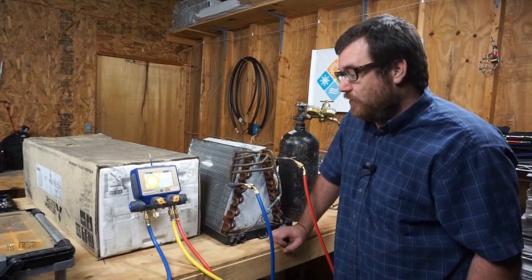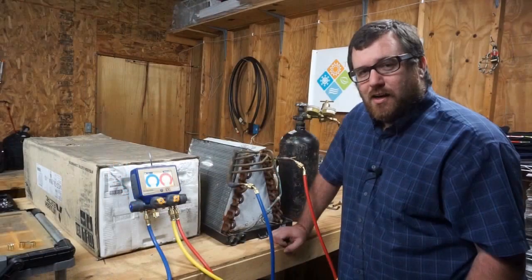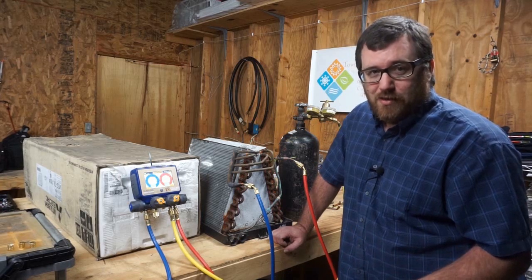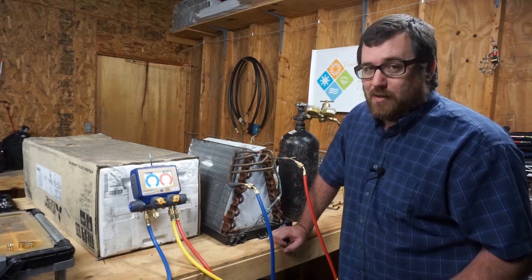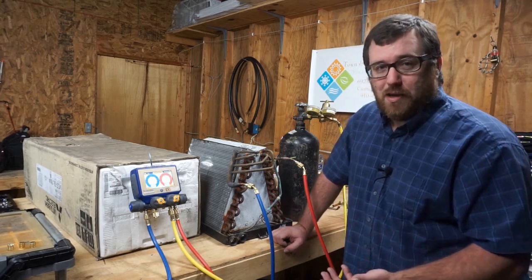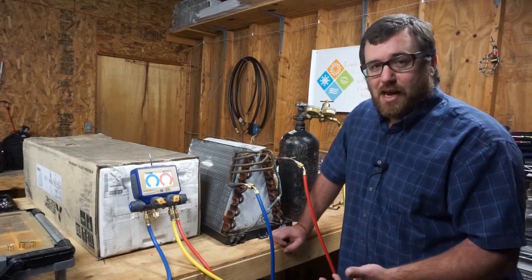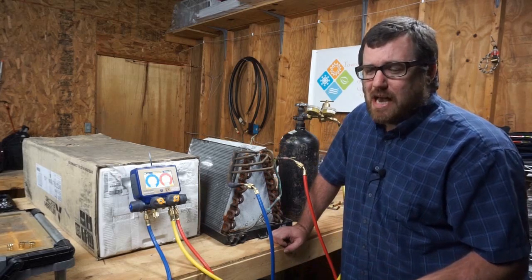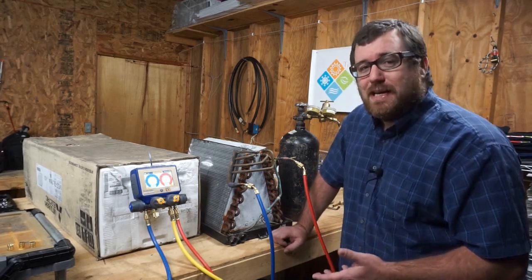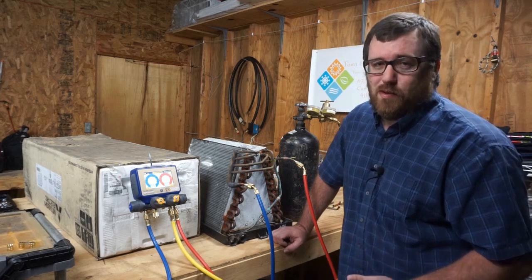Great news — the coil doesn't leak after all, guys. Of course it leaks. A lot of times when I was in the field, we would see fluctuations in the pressure and it wasn't very alarming — refrigerant might still be in the system. This is an older coil, so if we were replacing a different part of the system and we saw a pressure drop of 1 PSI, we might think that's okay. But this sort of proves that there could be a real big issue — we need to be more diligent with our pressure testing.